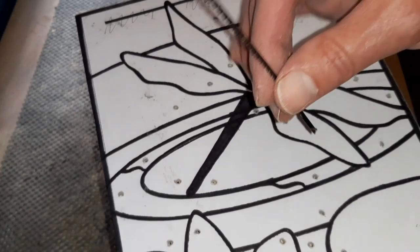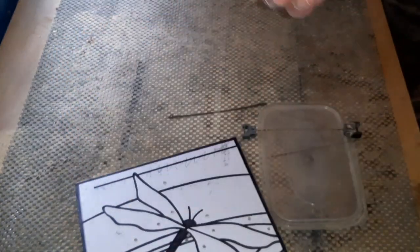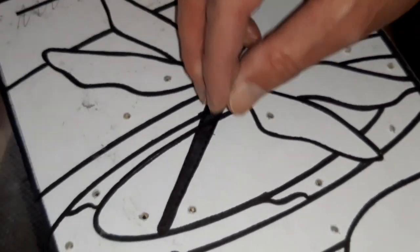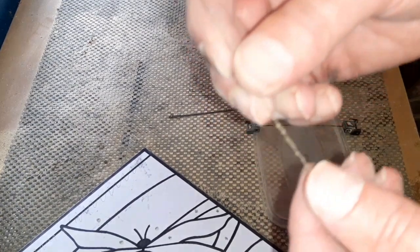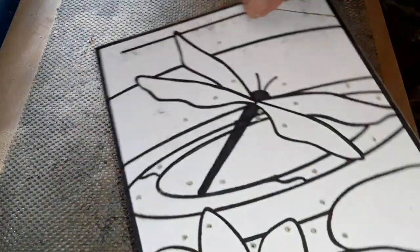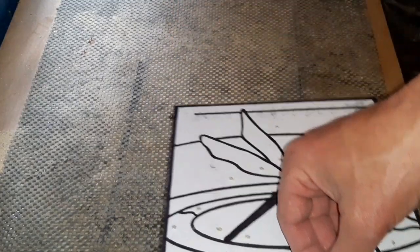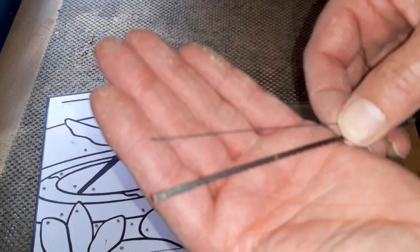We will get away with this on this one — there's one little hole there we might just struggle to get into. Personally I like to drill the bigger the hole the better because I've got to feed that blade in from underneath, so why make it a small drill hole? However those two there are going to be tight to get the blade in, so they come out with a pinless blade. Really fine work — you might just about get that on there. They're ideal because obviously there's no pins on the end and they will just fit into those little holes no problem. They're only for fancier saws and there'll be a clamp at top and a clamp at bottom to hold it in place.